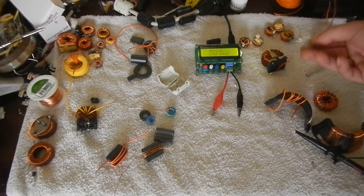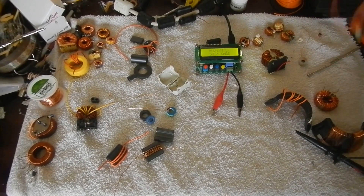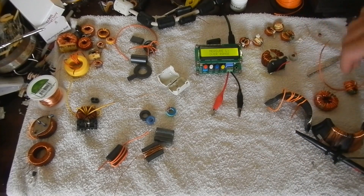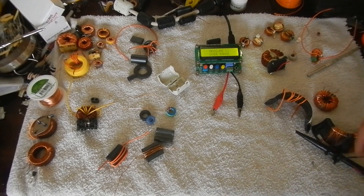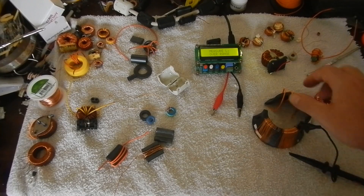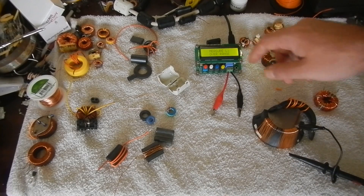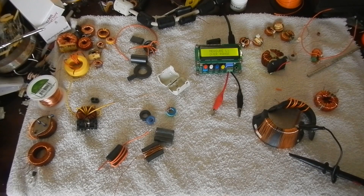So to summarize: grey cores are good and perform better at higher frequency. Frequency matters, split cores have different results, and some cores go better at high frequencies while some go better at low frequencies. If you can look up the datasheets on your cores it's well worth doing, otherwise it doesn't hurt to have an LC inductance meter. Thanks for watching.